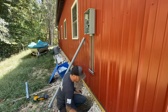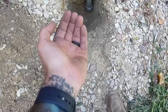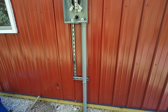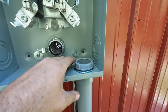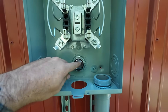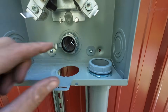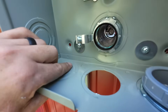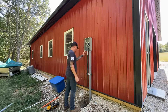Down at the bottom this two-inch has a connector with a plastic bushing just to soften that edge for their wire to come up through, and I've got a two-inch rigid strut strap — a two-piece strut strap — that secures it nicely within three feet of that box. Then I've got a two-inch PVC connector with a two-inch lock ring and a two-inch plastic bushing. This is where the utility wire is going to come up and terminate into these upper lugs — the neutral will be right here in the middle, and then through this one is where our wire is going to come through to the panel. They actually specify that you put the connector on the outside — either this side or that side — so they can come straight up around and land their wires.